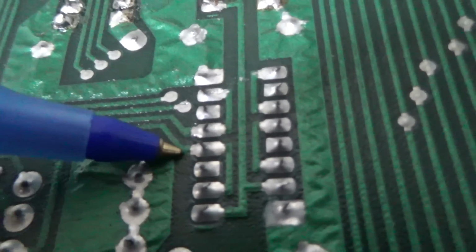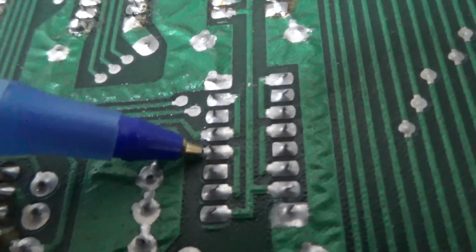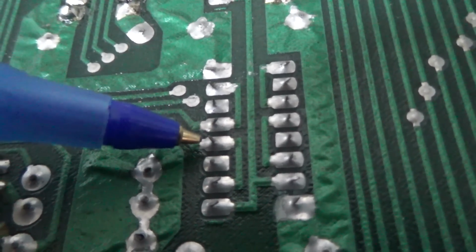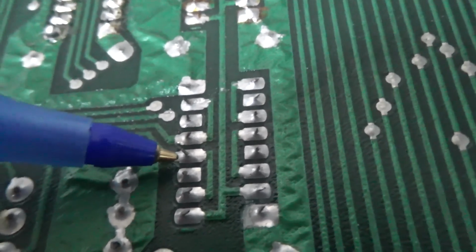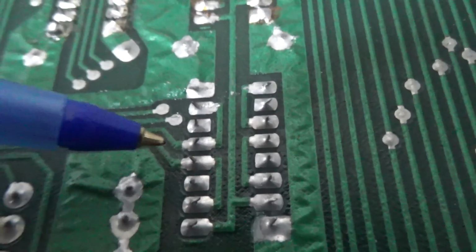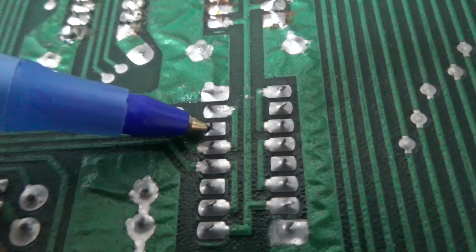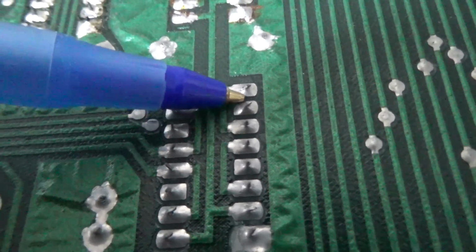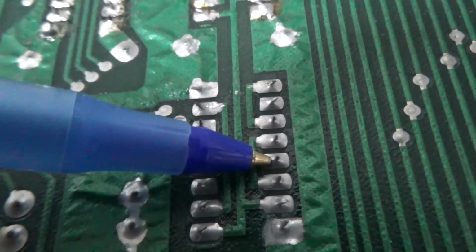Okay, so remember the first D0 came on pin 2 and pin 4. Look how they have them tied together. That's just so weird. It must be a NAND gate or something, you know. I don't know. So 2 and 4 are here, and the output is the one in the middle, pin 3. Okay, and then 5 and 7 are the input of the second one, and pin 6 is the output. And then 9 and 11 are the input of the next one, and pin 10 is the output. 12 and 14 are the input of the next one, and 13 is output.